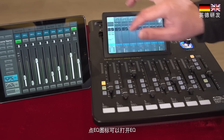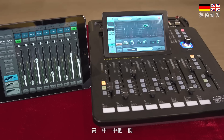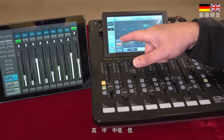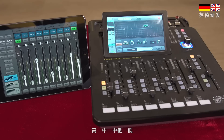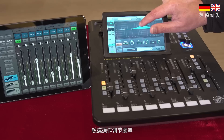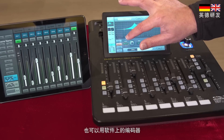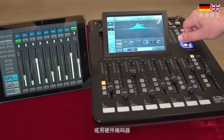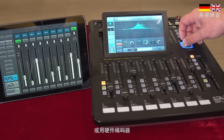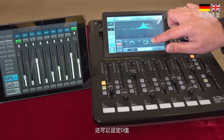The EQ can be opened by touching the EQ icon. It's a standard 4-band parametric EQ, fully flexible. Although we name the bands high, high mid, low mid, and low, each band can actually be set to any frequency you like. It can be operated by touch, by the soft encoder on the screen, or even by the hardware encoder to the side. Of course we have Q control so we can narrow or widen the band.